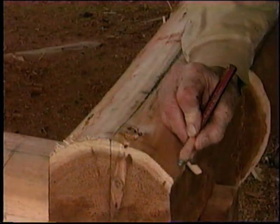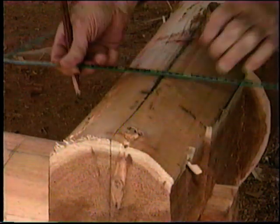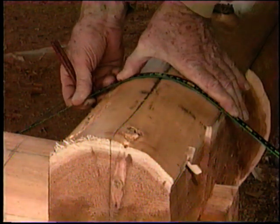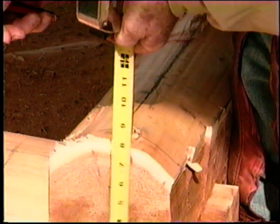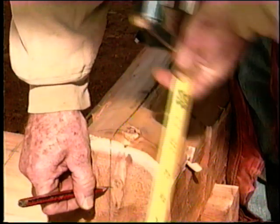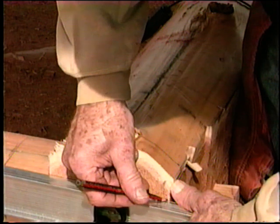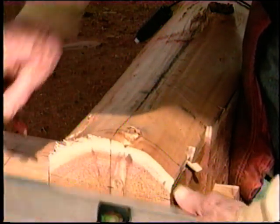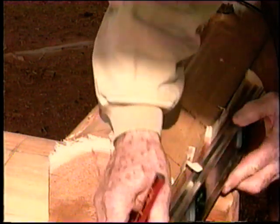The first cut for the next logs should be done in much the same way. Join the existing vertical lines across the top, then place the level marks approximately 3/4 of the way up the center line on the end. This height may vary according to the log size. Join the marks, cut the slope, and you are again ready for your next piece. The quality of your work will depend entirely on the accuracy of your layout and cutting.